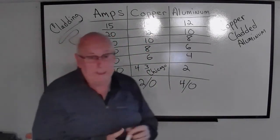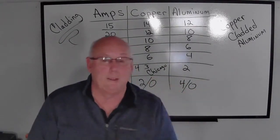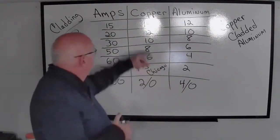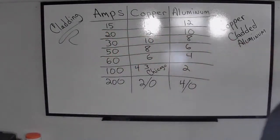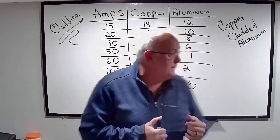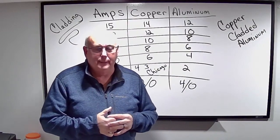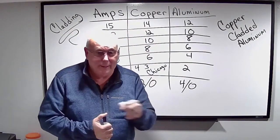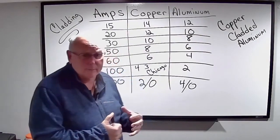This chart up here, I'd like to encourage you to write it down and memorize it. Every home inspection that we do, we're going to look at the breakers, we're going to match them up with the wire sizes, and make sure we have the right size breaker. You know, many times we're going to see things that are over fused. It's common. All right. So if I got a 14 gauge wire on a 20 amp breaker, it's not designed to carry that. Let's see if I can switch these lights a little bit. It's not designed to carry that as much. And when that happens, that's considered over fusing. Now, in all reality, and I know I'm recording this, so I guess I can't deny it, I really don't see that as a big deal if I got a 14 gauge wire on a 20 amp circuit. It's wrong. I'm going to identify it as being wrong. We're going to document it. But fixing that is just put the right size breaker in there.